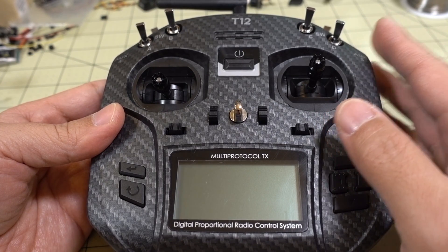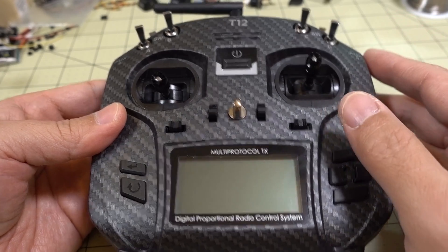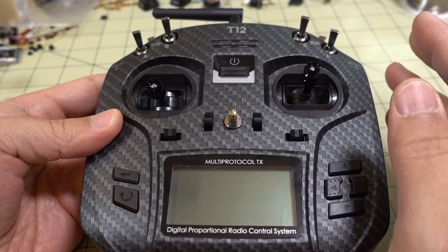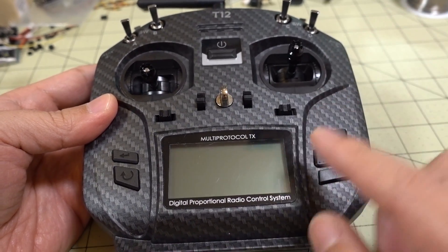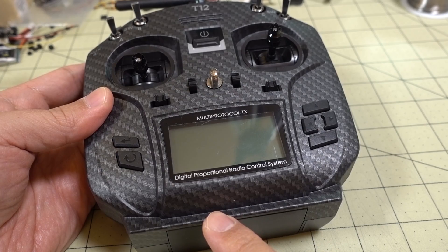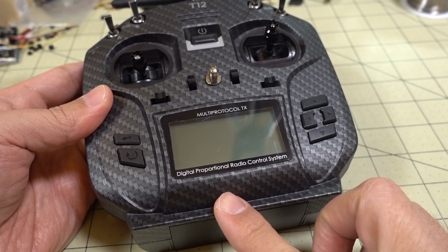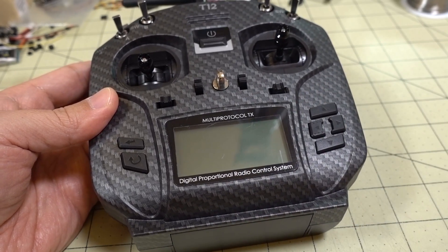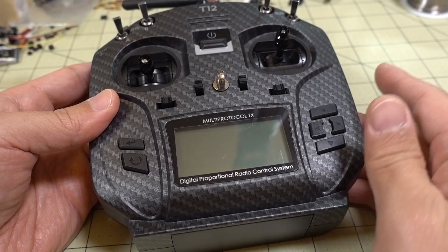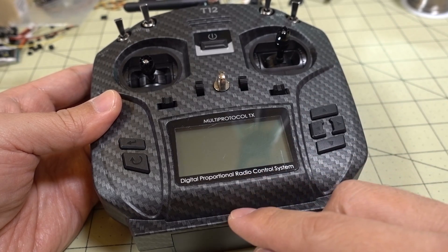There are different approaches to actually updating the firmware on the radio itself. What I've done is saved the files to a microSD card that you can put into the bottom of the radio. Unzip the SD card contents and save everything to the root of your microSD card. I'm using a 4GB microSD card — you can use something as small as 1GB, but it is a little picky, so you probably want a high-quality card that's at least class 10. You can use up to a 16GB card without any issues.